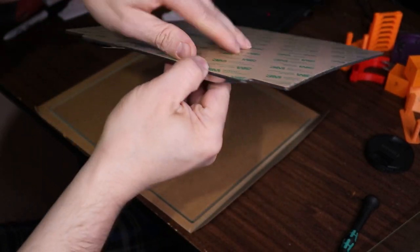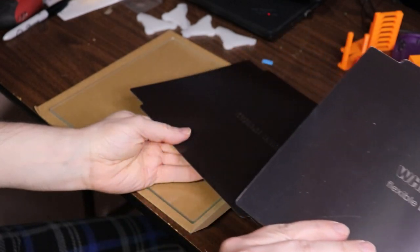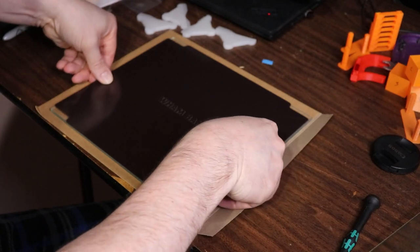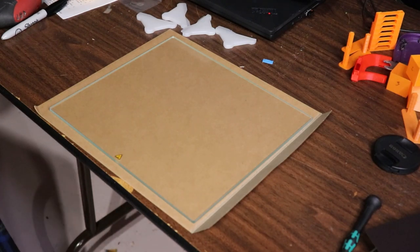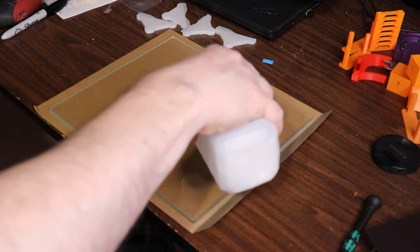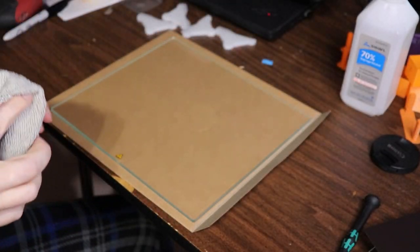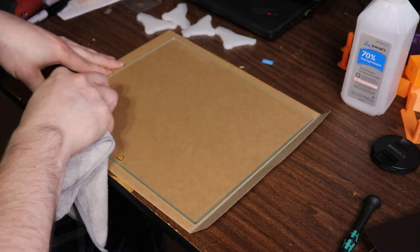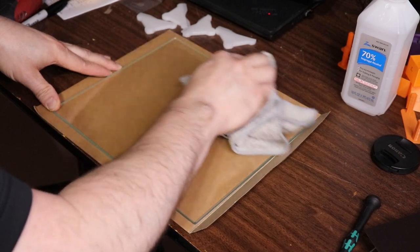Okay, it's editing voice Paul. This is the Wham Bam — this is the magnetic bed, and there is the PEX with the spring steel bed. There is also the glass bed I received from Fabricate. Before doing anything, we're just sizing everything up, making sure that magnet is going to fit the glass bed — and we're good there. We want to make sure the surface is clean with no human oils before adhering the magnetic bed, so I'm using some 70% IPA and a microfiber cloth to prevent any lint from getting on there.